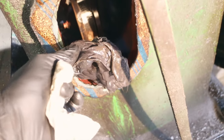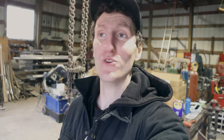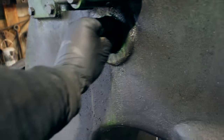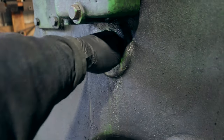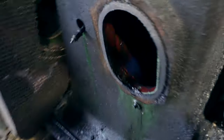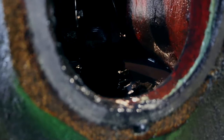Take a look inside here — can you see that stuff down there? I'm going to grab it. Look at that. Do you know what that is? We're going to put that back in there for now. From a Tim who was so frustrated of breathing in oil that he was sticking paper towel in here to plug the vent hole — and over time it slipped in and worked itself down and is now sitting in the oil. So that is super, super bad.